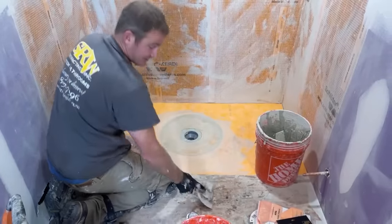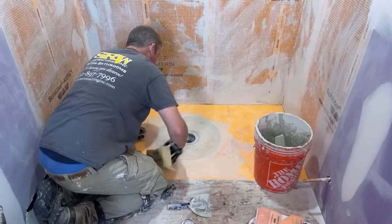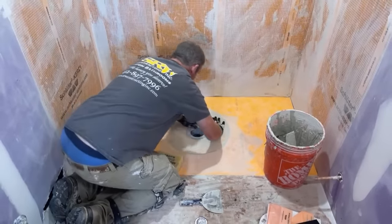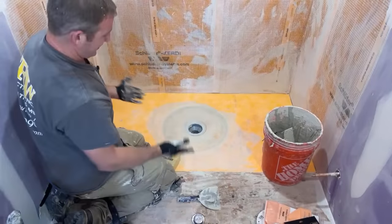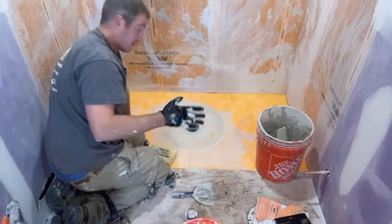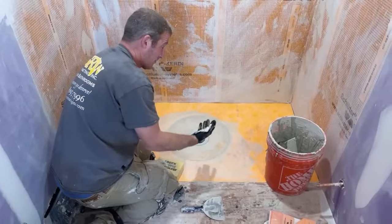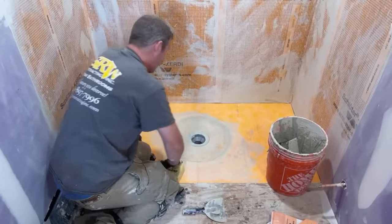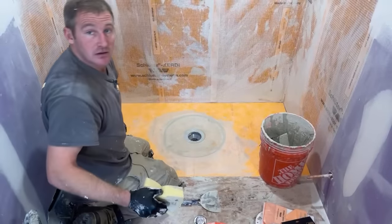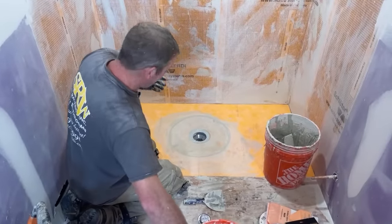You'll learn a lot about setting tile. Well, not setting tile, but all their stuff, their products. And one of the things that they really do explain to you is how in the world is this waterproof when you're using thin set? It really, in some ways, doesn't make sense. And I certainly didn't understand it when I first was putting it together. Like, how is thin setting the membrane together actually going to make this waterproof? Well, what keeps the water from working its way through the thin set between the flange and the fabric? Exactly. That's exactly the confusing part: how does that work?